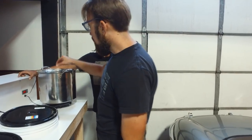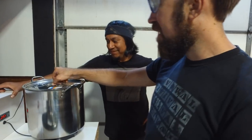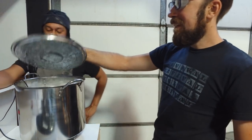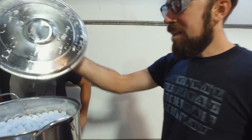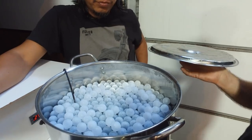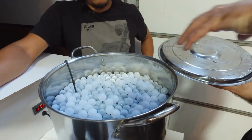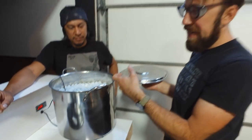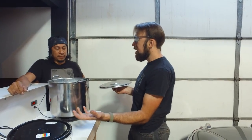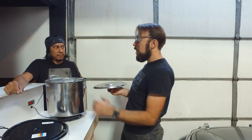The last step is the rump roast. That's right. This is where we've got our pot roast going because lunch is coming up soon. Yeah, this whole process, you know, it makes you very, whoa. Look at these balls. These balls are here just to try to keep some heat in. When we're actually anodizing, the cover doesn't fit on this very well, and this bath needs to be closer to 100 Celsius or 200 Fahrenheit, just under a boil.